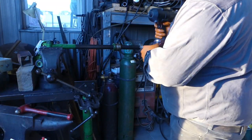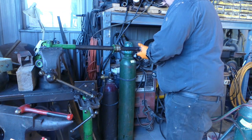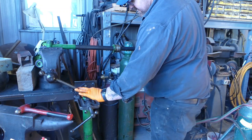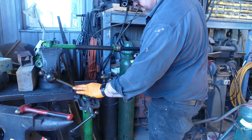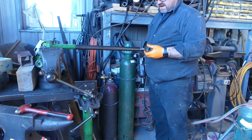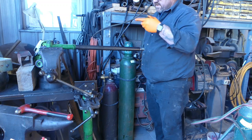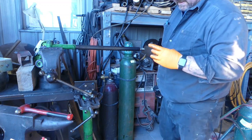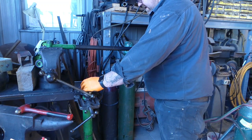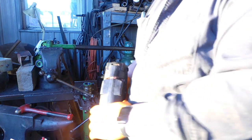So we're gonna take our Milwaukee. She's dialed up on number three. We're gonna pop that nut off. Set it right there. Piston off. I like to set the piston the way it comes off. Now our head gland comes off. We're gonna leave this snap ring on here because if you forget that, you gotta take it all back apart. So here's our actual head gland. We're gonna reseal this, reseal the piston, and we'll be on our way. So let's get that done.